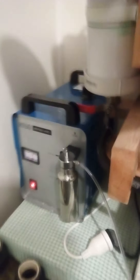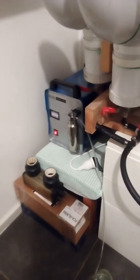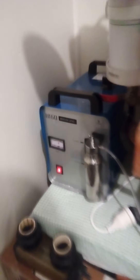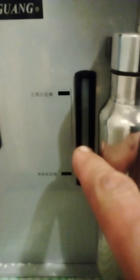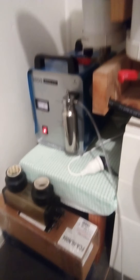Just like I said, allow it to cool down. 350 grams of caustic soda to 700ml of distilled water, and put it in a glass jar when making it and allow it to cool prior to putting in the top. And do not overfill it. You can pick these up for about $140 — and they're a jewelry factory making machine. They only make jewelry.